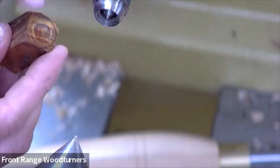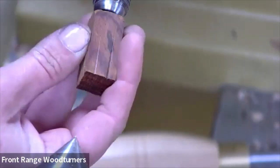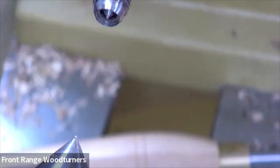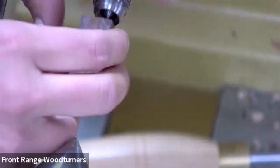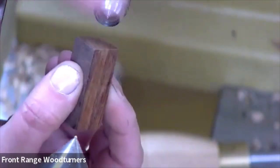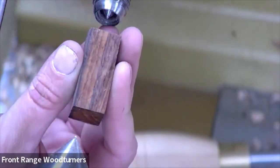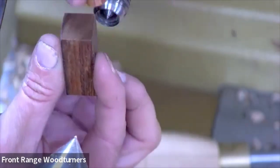Well, before I put it on here and centered, I should have flattened out this end that I just parted off of, because it's going to go in here, and so I can't touch that end now. So I'm not going to use that piece because I didn't do that, but I'll use something quite similar. So before taking it out of your long nose jaws or whatever you're using, flatten the surface off, make it straight on the one end, because you won't be able to access that point. And this point will be the top of the body, so it'll go up here, like so.